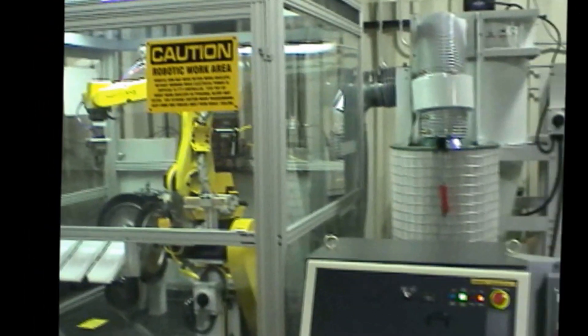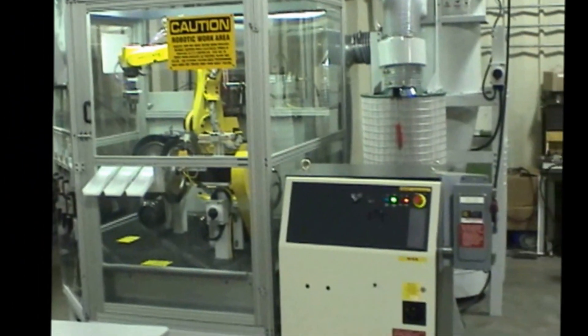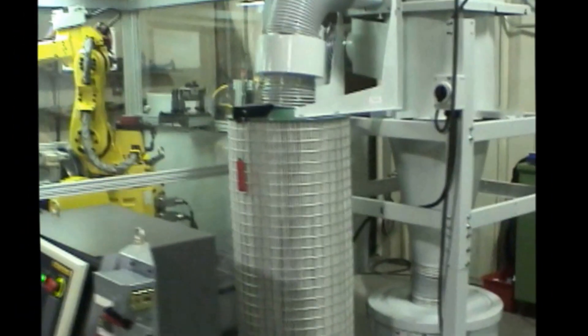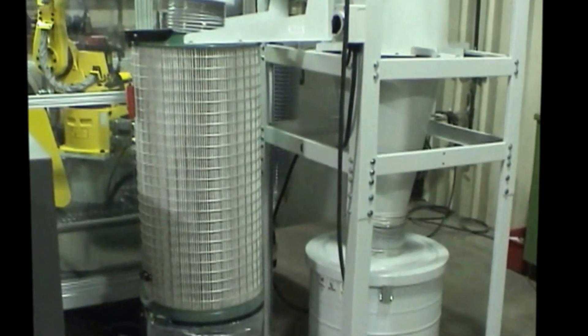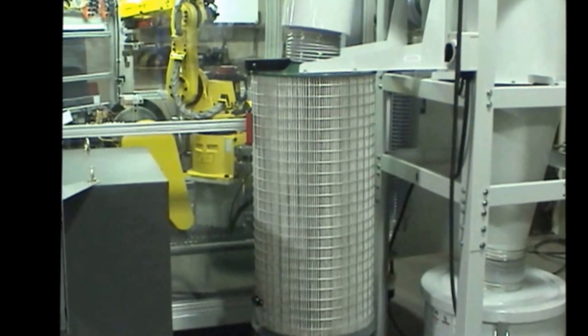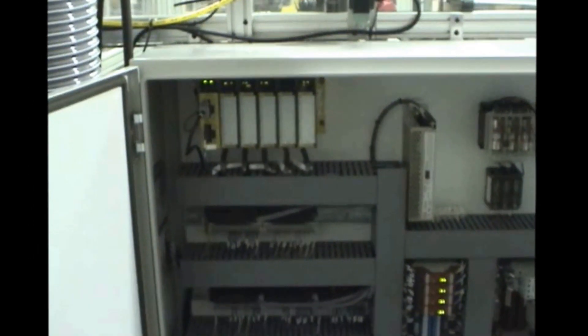Now I'll take you for a quick walk around the work cell. There's an access door there that you see from the front. We have the FANUC controller. Since this is a temporary setup in our workshop, please ignore the lines and hoses on the floor. We have a dust collection system for the major particulates, and also a filter for the dust to keep it out of the air — so this returns the air right back into the same work environment. Back here we have the control enclosure — you can see the ductwork, the control enclosure, the pneumatics. We remote-mounted the FANUC I/O rack into this system, so indeed there is no PLC controlling this — it's all from the FANUC controller.